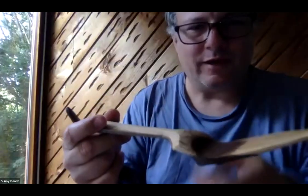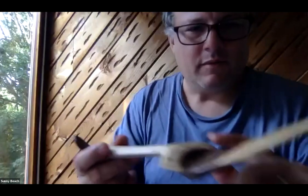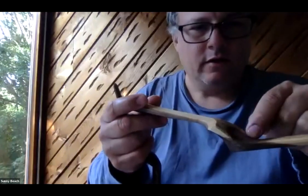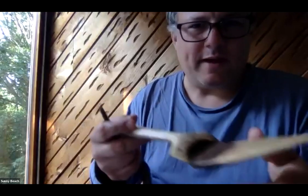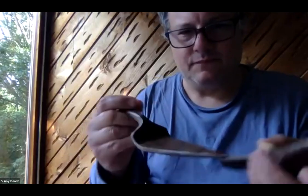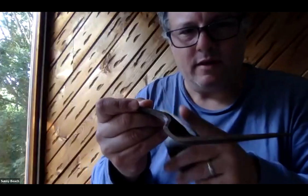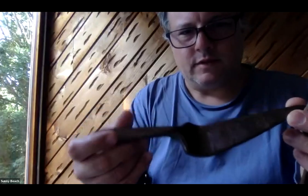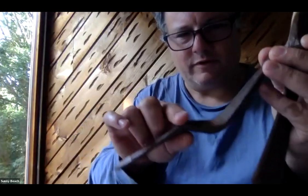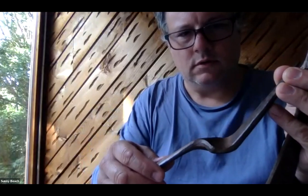I think the interesting thing for me after making two of them, I was always questioning where these shoulders should land. Both of these have like a spoon type crank or a shoulder up high to catch whatever's going to roll off the back. But I noticed other people kind of cut in lower and started the handle a little bit lower and made it more like a spatula, in my opinion. I think that's an interesting design consideration of where you have that bend and where the shoulders come in. Yeah. It definitely makes it more difficult to have a perfectly flat transition right here and a really wide shape at the same time. Yep.